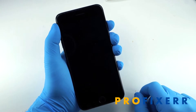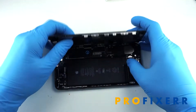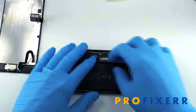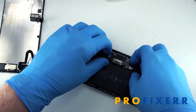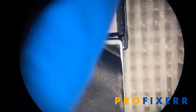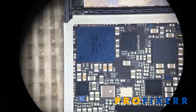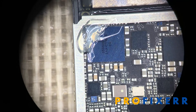This particular phone actually took about five minutes to boot — it took forever. That's another indicator too: if it takes a really long time to boot and gets stuck on the Apple logo but still has home button feedback, then an audio IC issue is pretty likely. So after testing all of those things, it's pretty much a dead giveaway that it's audio IC, so we go ahead and pull the board and get it prepared to remove the actual audio IC chip.